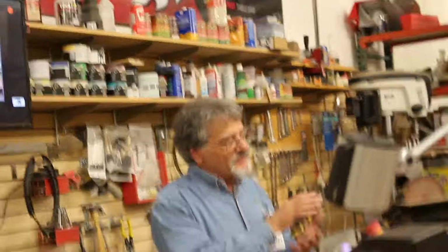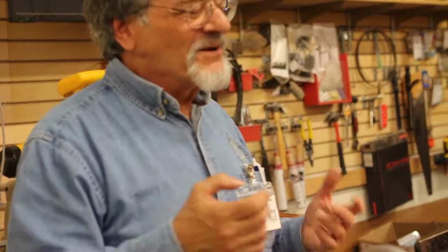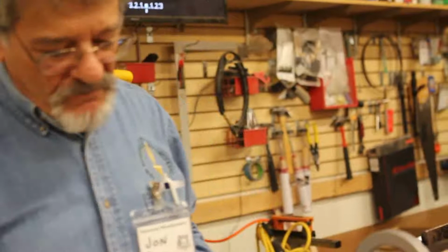I'm gonna back up a little bit here and talk about something very basic. So beginners, afterwards, so many people come up to me and say, you know, that was really an aha moment. And I'm gonna show you something here that you may already know, but I want you to think very carefully about this. If you've used chisels at all in carving, or even mortising a hinge, or if you use handheld chisels, I'm sure that you know that there's a certain angle that the bevel is ground, and as I put this chisel against the wood, I'm going back and forth here, nothing's happening.